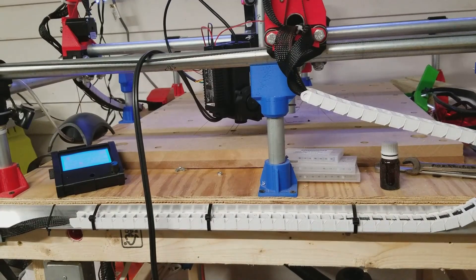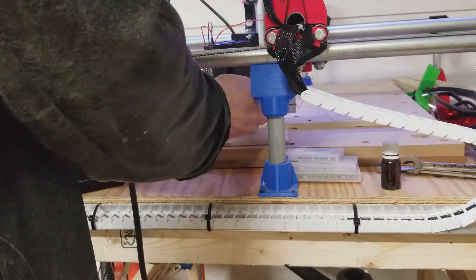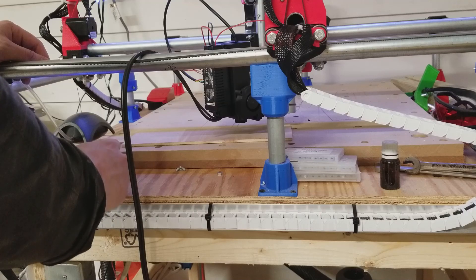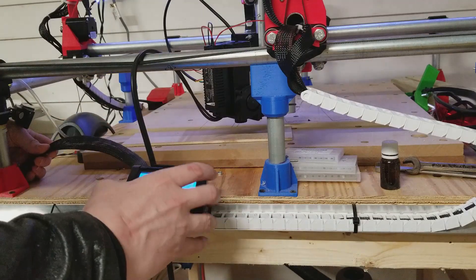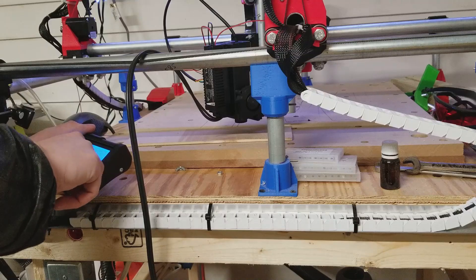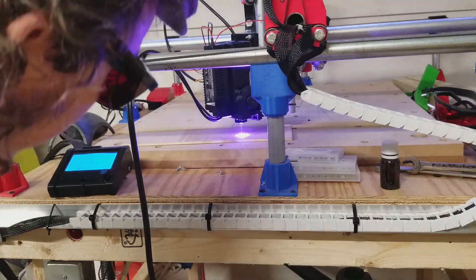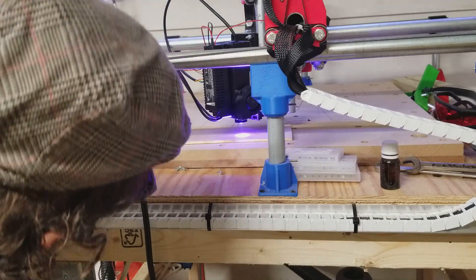Safety glasses on. We've got a little test piece of wood. The laser is powered up but the TTL data line is telling it to have zero energy. I've put it pretty much where I think the focal point is. I've reprogrammed some of the interface to give direct access to laser power. We're going to immediately crank it — yolo — hope it doesn't explode. Oh, that's bright! I'm pretty sure I've got the focal point down, and it is not producing smoke, which is great — all that extra oxygen from the blower fan is keeping it from being a dirty burn.